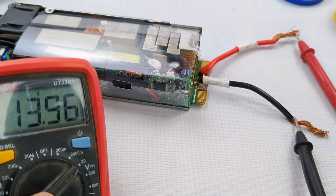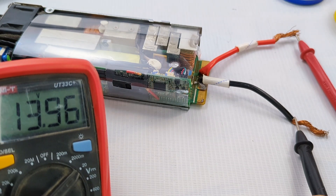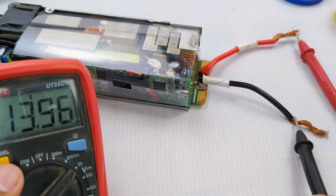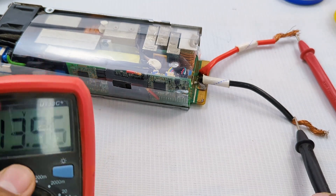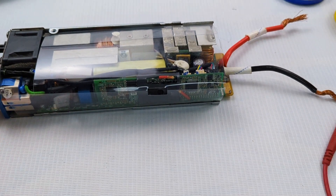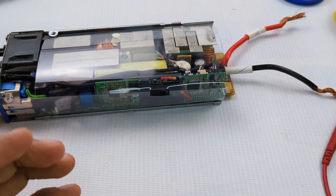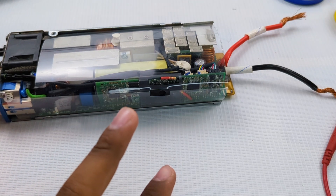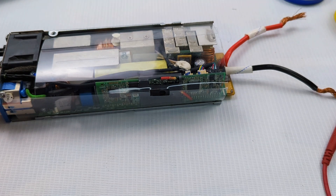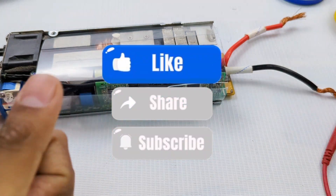You can see that the previous output was 12.6 volts. To fix it at 13.8 volts you need a 6.8k resistor, but I used 5.6k — it's good for me and I can use it in some applications and to charge my batteries. So that was the tutorial. It was simple — I just told you the two points where you have to solder the two resistors: the first one to increase the voltage, and the second one to bypass the over voltage protection. If you have any questions, ask me in the comment section. Don't forget to like, share, and subscribe to my channel. Stay tuned for the next video.